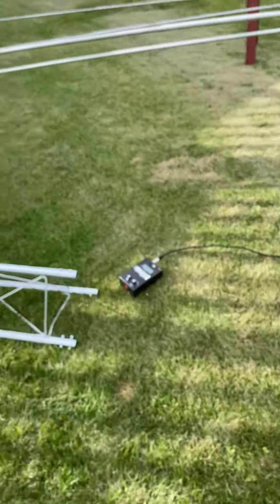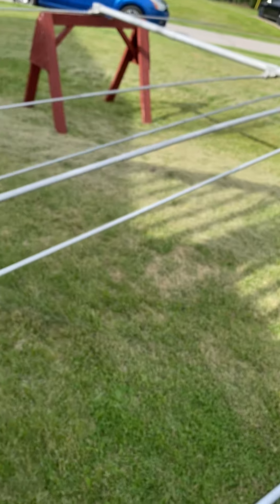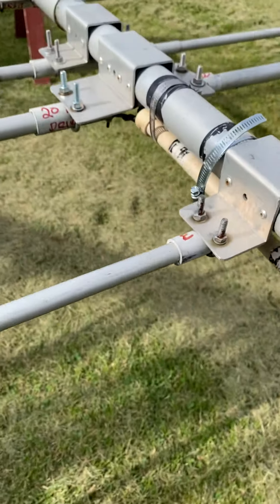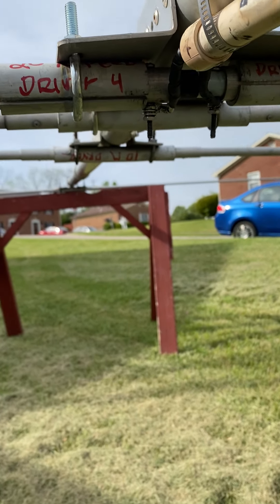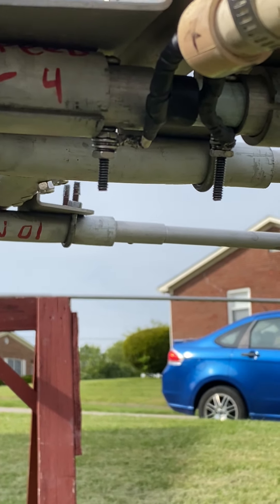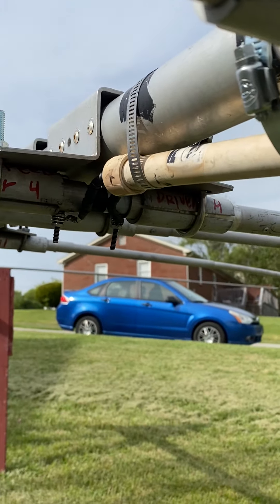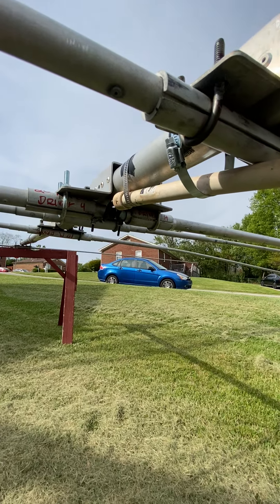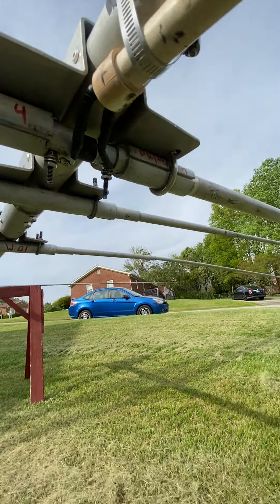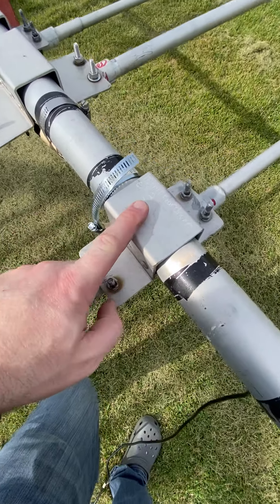It's a little heavier than the Mosley TA-33, but no traps. This is the 20 meter driven element. My biggest complaint about this antenna is the actual feed point which is under there. You've got two screws on each side of the driver for the 20 meter element, and then this cheesy looking one-to-one choke - I think they still sell those - goes under there. But the wires are awful thin up there, you can't tighten those without moving the wires. I may look at doing something a little different on this.